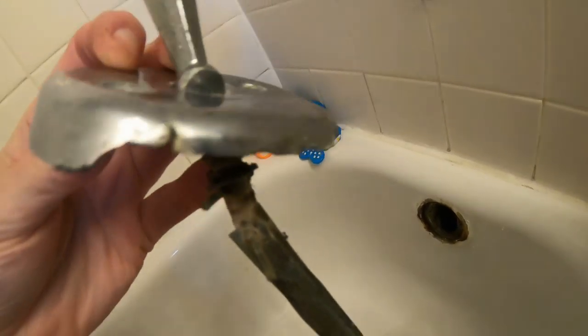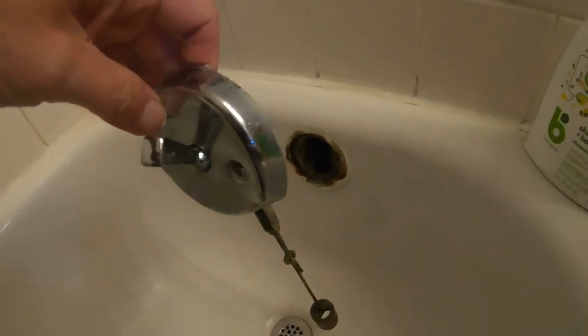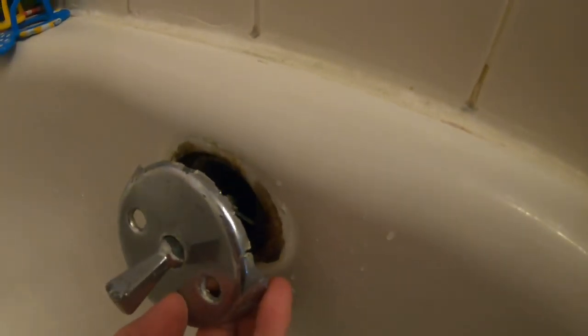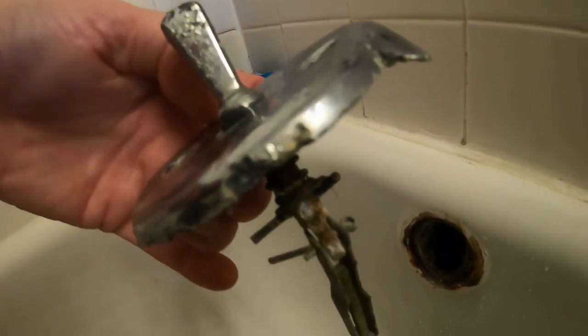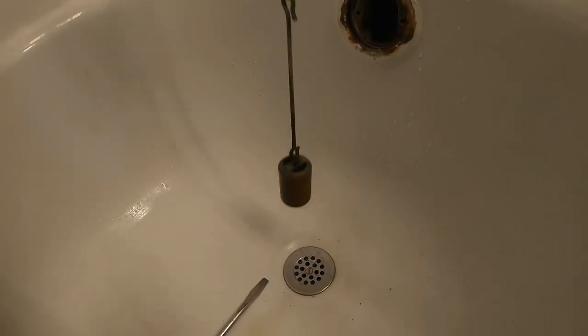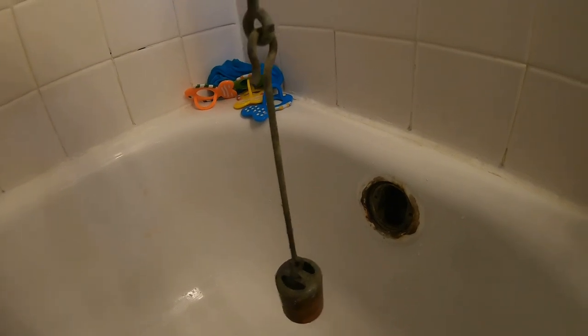You can see a little corrosion in the bottom. One important thing: you want the open side always at the bottom, as that's a pipe and it will drain if it overflows. If you have it facing up, it'll get super full and spill. You want your closed section — which is all corroded — facing down. This piece just lowers into a pipe down here, and that's literally how it blocks the drain — it plugs that side with this little bucket.